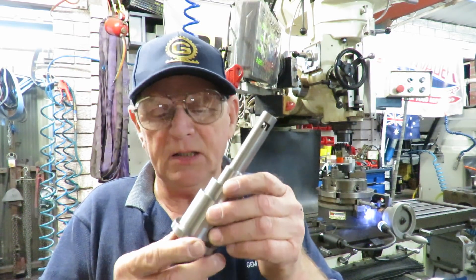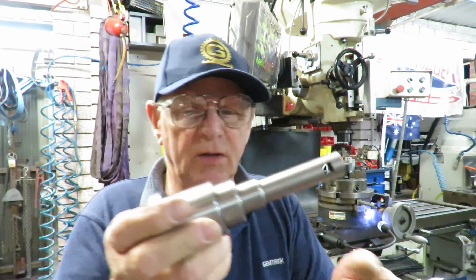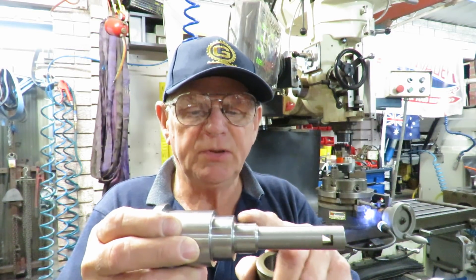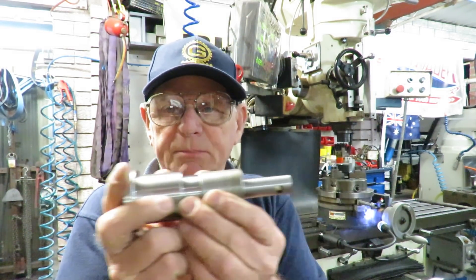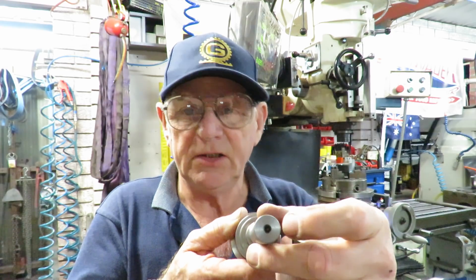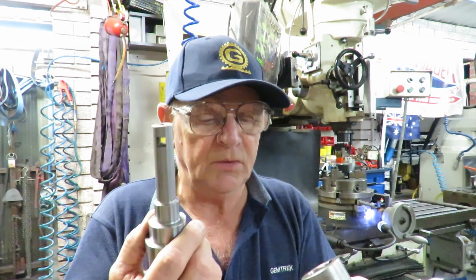So today I've made up another one, and this one is for cutting keyways in these bushes — these particular bushes. Let's have a look. This is the section that goes into the clapper box, and then we reduce it down a little bit. This particular size here is a neat fit on the socket, and they use that to centre up the ram to make sure we're on song. This one's not finished — I've got another one on there at the moment that still has to have the hole drilled and tapped with a thread. That'll be full-size for eight millimeter or five-sixteenths square cutters — high speed cutters.